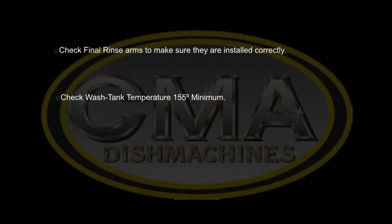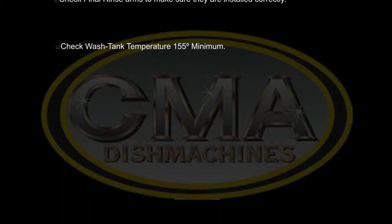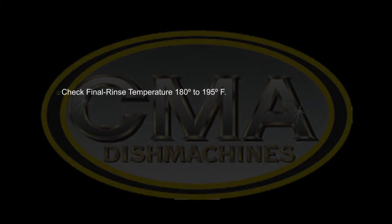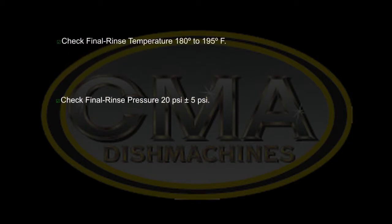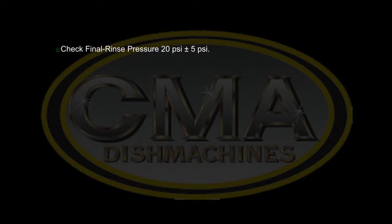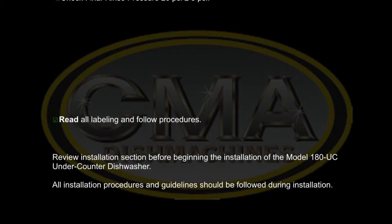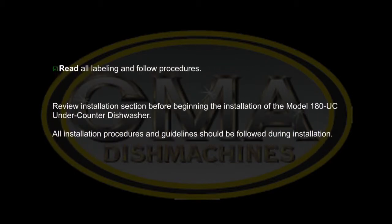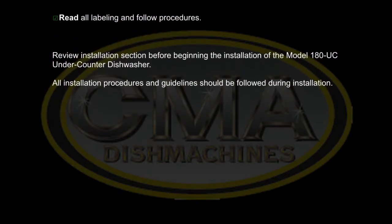Check the wash tank temperature should be 150 to 160 degrees. 155 degrees is recommended. Check the final rinse temperature should be set between 180 and 195 degrees. Check final rinse pressure. 20 psi is recommended, plus or minus 5 psi. Please also remember to read all labels and follow all installation procedures. Please remember to view this section before beginning the installation of the CMA Model 180UC under-counter dishwasher. All installation procedures and guidelines should be followed during installation.